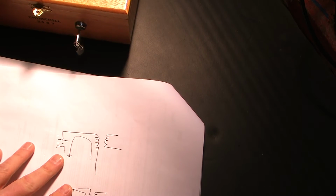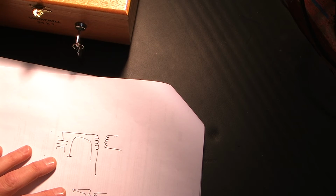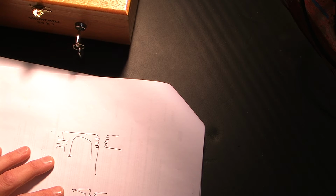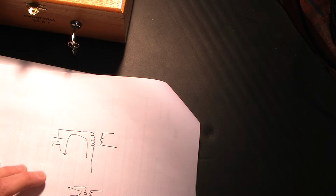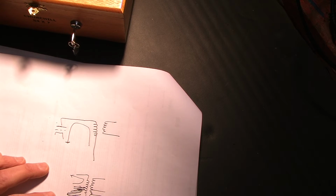And because this is such a low power amplifier with a pretty low idling current, I think the quiescent current is maybe somewhere around 40 milliamps, maybe 20. I'm not sure. I've got to plot a load line on this thing. That's something for a future video. I'll try to plot a load line, if I remember how. My God.